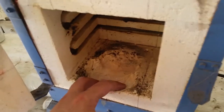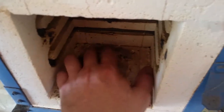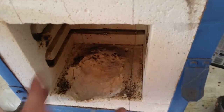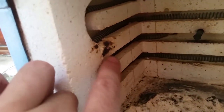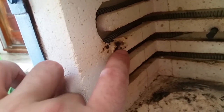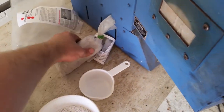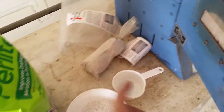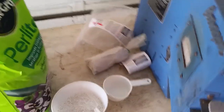Now I have all of the old cement and borax chipped out. The black you see in here is leftover from the graphite plate — I didn't think it was a big deal to remove all of that, I just primarily needed to get the borax out so it doesn't continue to eat through once it turns to liquid. I've also got a spot up here that holds the coils that needs to be patched. This cement calls for four parts cement and one part water, so I'm going to do two cups of cement and a half cup of water, stir that up, and throw it in here.